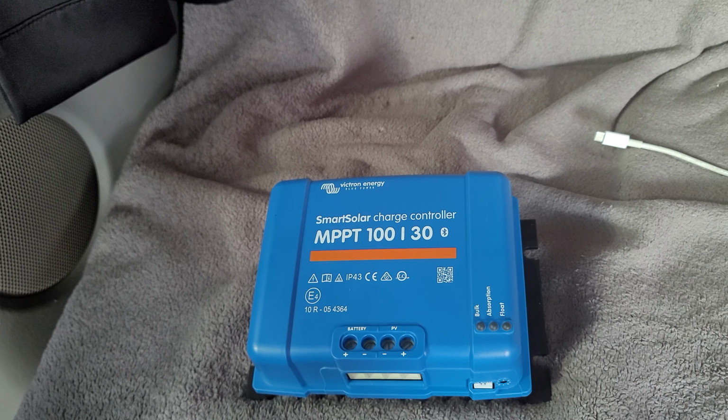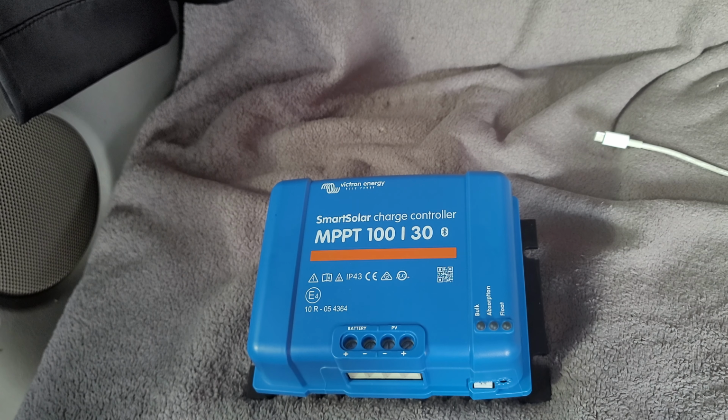Description: a solar charge controller gathers energy from your solar panels and it stores it in your batteries. Using the latest, fastest technology, Victron Energy Smart Solar maximizes this energy harvesting, driving it intelligently to achieve full charge in the shortest possible time. Victron Energy Smart Solar maintains battery health, extends its life. The Smart Solar charge controller will even recharge a severely depleted battery. It can operate with a battery voltage as low as 0 volts, provided the cells are not permanently sulfated or otherwise damaged.